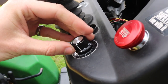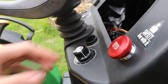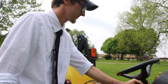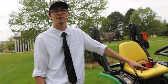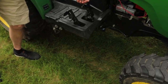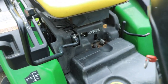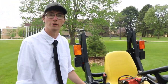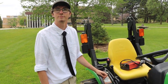Our potentiometer here, which is labeled backwards, spins up our motor. That's our throttle control. Full speed is at 50. That's about as loud as she gets. Right now the tractor wasn't going anywhere even though the throttle was going, because this tractor is hydrostatic. That means you have pedals down here which engage a clutch in the hydrostatic transmission, which increases the dampening between plates and ends up moving the tractor, similar to a clutch in a car. Everything on this tractor is hydraulic powered, so the motor is connected to just a big hydraulic pump.